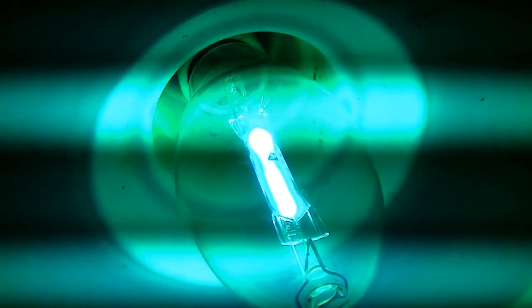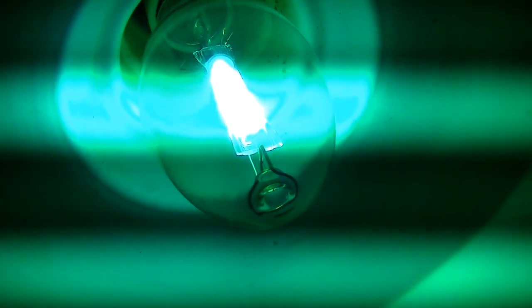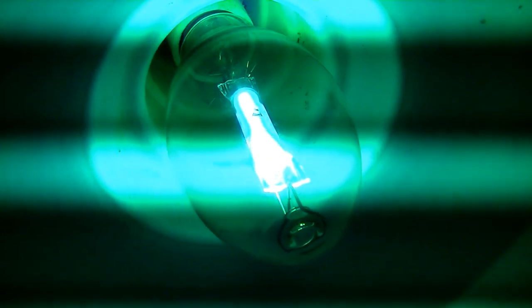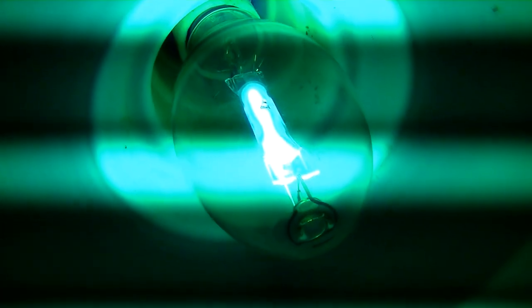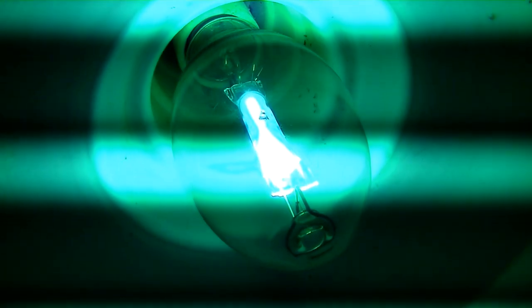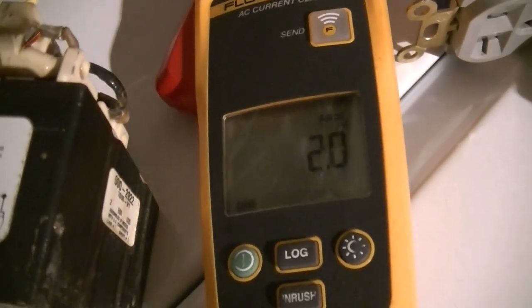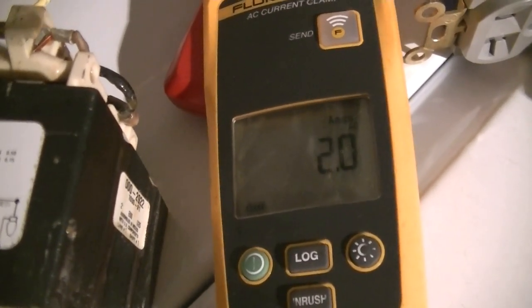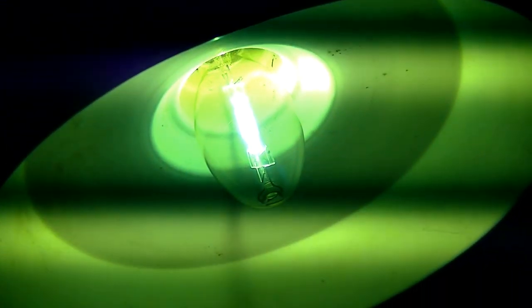You can see there is the lamp, still at fairly low power because the discharge is still very diffuse. Even as I'm looking at it, the discharge is coalescing into the approximately one-eighth of an inch diameter plasma stream that it is when the lamp is at full power. Only a minute or so in and we're already down to 2 amperes. And there's the lamp all run up — with the lamp fully run up, operating current: one and a half amperes. Like I was saying.